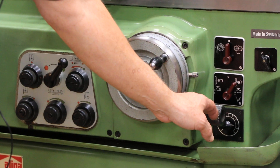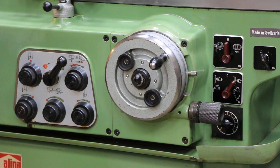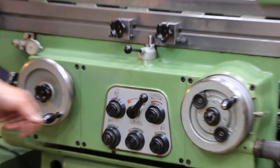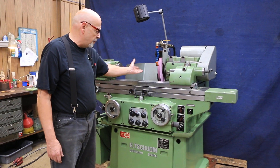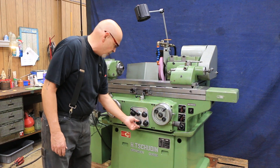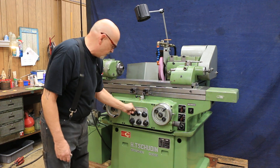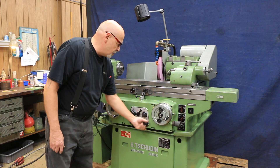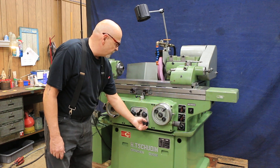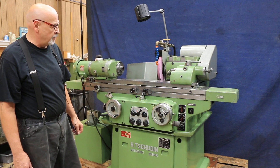You have a fine adjustment on the side here to fine-adjust your stop pin in case you're a little oversized or a little undersized — you can move the point where it actually comes to the solid stop. As you send the head back, the amount that you just took off retracts, so your stock removal retracts. Then you can shut the table off and start your plunge feed, which is right here. This adjusts that, and there's your continuous in-feed or plunge feed.